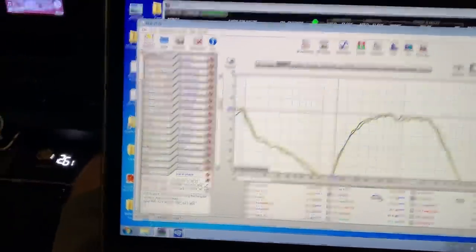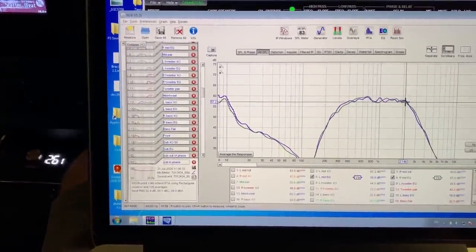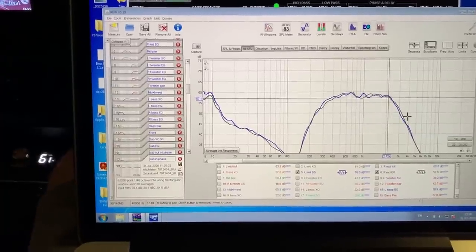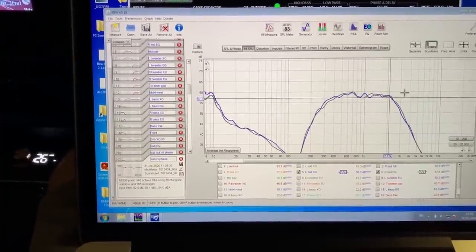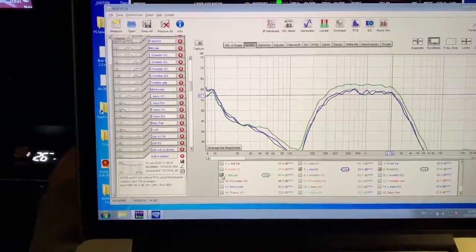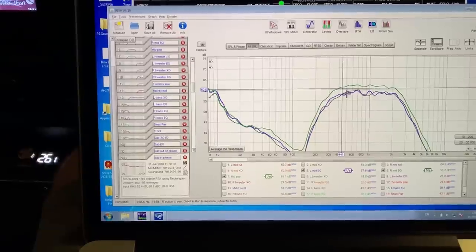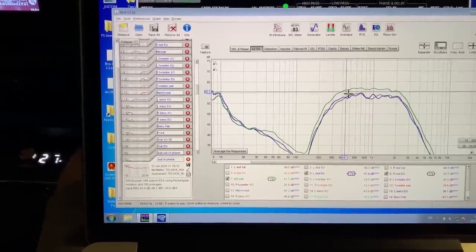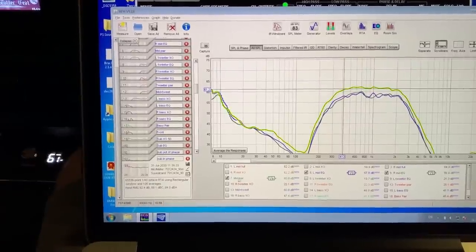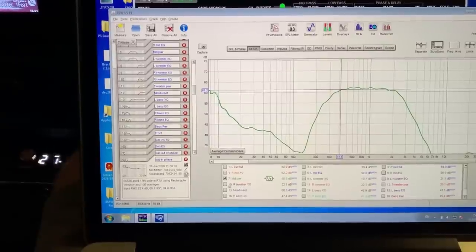Back to measurements: the mid-range is crossed at 290Hz with 24dB slope, then at 3kHz with 24dB slope, and even the slope is EQed out — because if you have a peak in the slope it will affect the range where the tweeter plays and the summation between the two drivers won't be perfect. Once the drivers are individually EQed and look very similar, I play them with uncorrelated pink noise and look at how they behave together, then EQ them as a pair to get a really nice linear response.